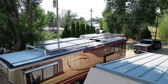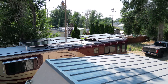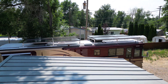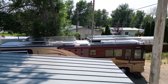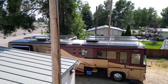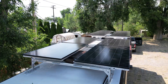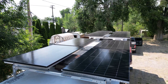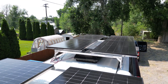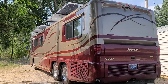There would be room for more solar panels along the backside of this RV, and had the vents and roof obstructions been placed slightly differently we would have had one congruent solar array. But it worked out great because we only needed to fit eight solar panels on the roof. Spacing them out like this makes it easy to get up on the roof, access the middle catwalk, clean and adjust the angles, and handle the panels as needed. The Monument Solar racking system distributes weight along the strongest part of the roof, so there's no concern of the roof pushing in over the long term.